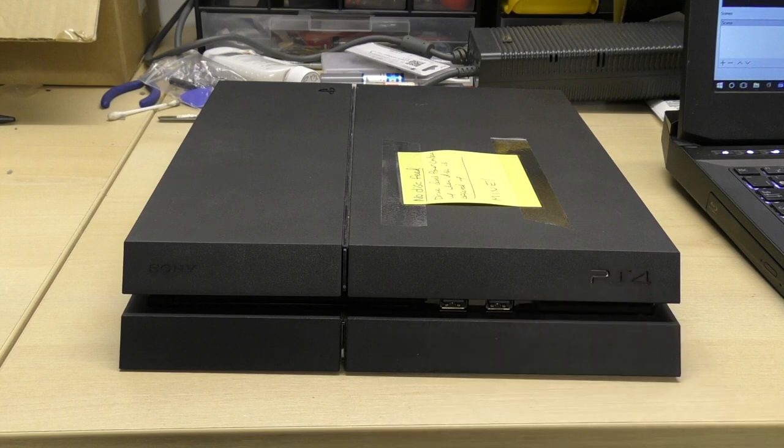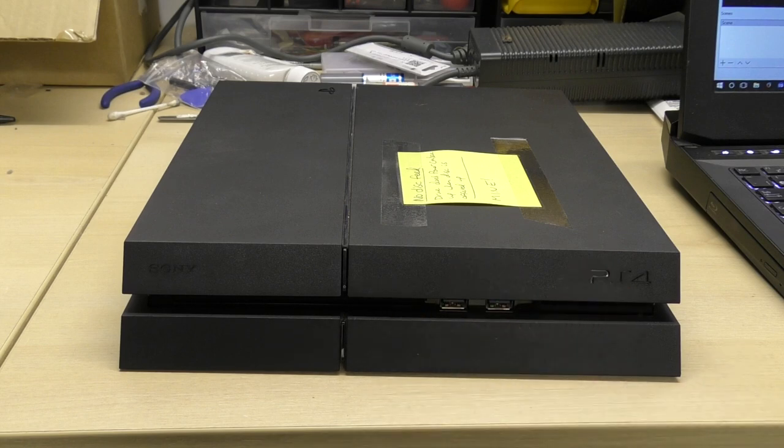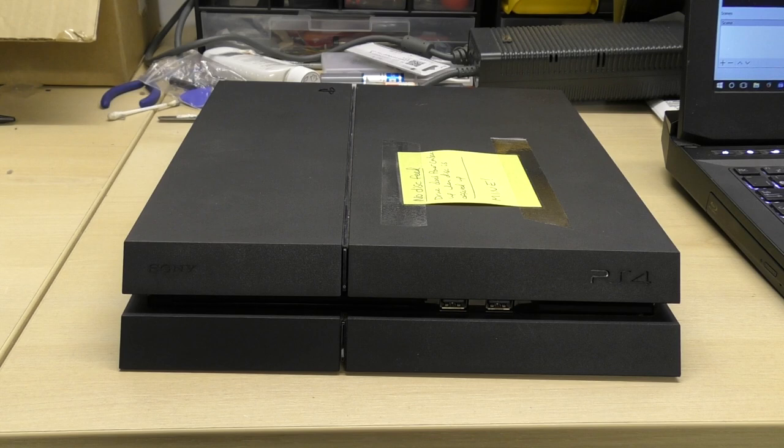because of course, more often than not, it was down to a mismatched logic board. But there were, to be honest with you, lots of instances of machines with faulty logic boards actually giving that error, where the things were warranty sealed, and allowing for fake warranty seals, because they do exist, and there's a video on that on the channel as well, and I'll link that down below so you can see those. But allowing for that, a faulty logic board also causes this error. And of course, we can't get that anymore. Well, we can get a faulty logic board section of the board, of course, but we can no longer get the biggest cause of it, which was mismatched logic boards. So it would appear that Sony themselves got sick of fixing them, which is cool, because it's a stupid error.